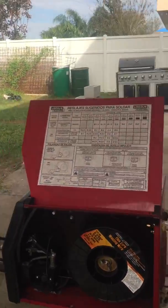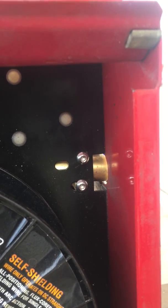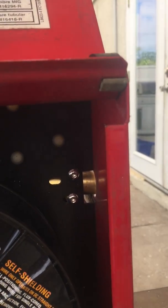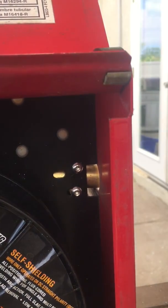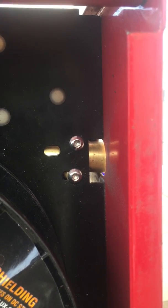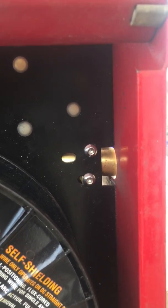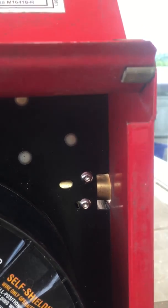On the sides here, you can see it. What I've done is drilled an additional hole on the top, which almost perfectly lines up with the hole below, which is a factory mount hole for the solenoid. This welder I bought off of OfferUp didn't come with it, so I had to buy the additional part, which was around $30. These screws are stainless — I believe they are 5/32s, but I'd have to double check. They are only about seven or eight millimeters long. This way they grab into the thread just nicely and you tighten them up with a small Allen wrench, and that's it.